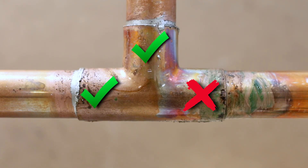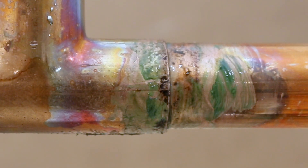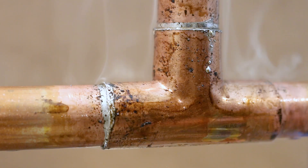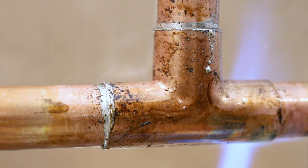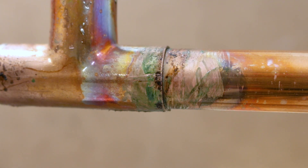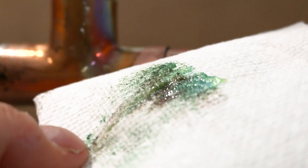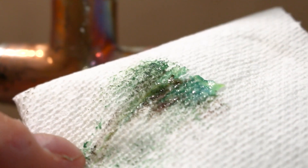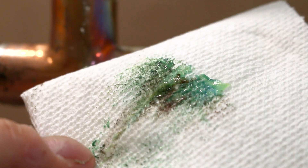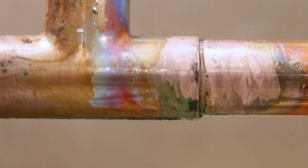Number one is not entirely soldering a copper joint at once. I'd often see this happen on the job where someone would start soldering a fitting but wouldn't finish it. There are a few reasons why you don't want to do this. Number one is the fact that the solder on the other joints could melt when you reheat the fitting. And secondly, the joint was fluxed and just left there without wiping it off. Flux is an acid — if left on the pipe for more than a day, it causes verdigris, which is a green encrustation caused by atmospheric oxidation and it renders the joint unsolderable.